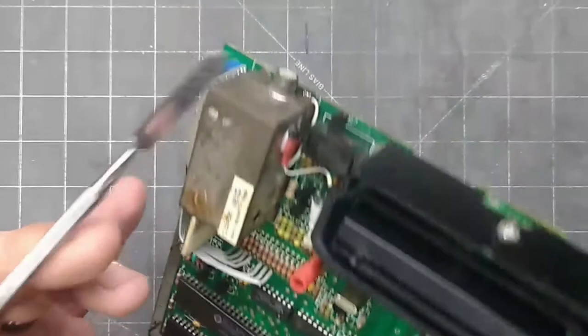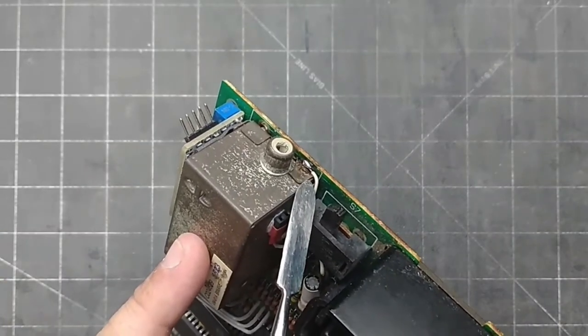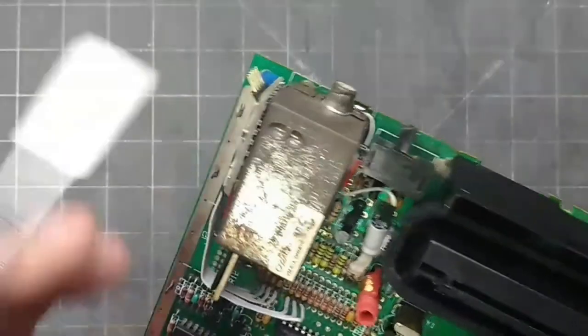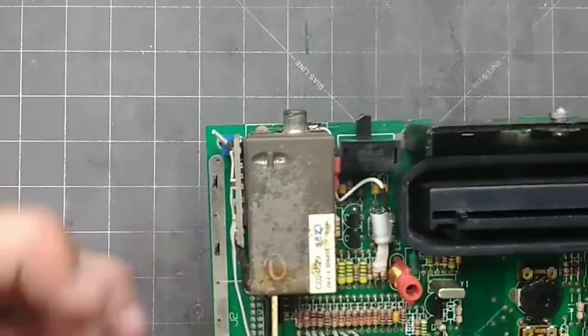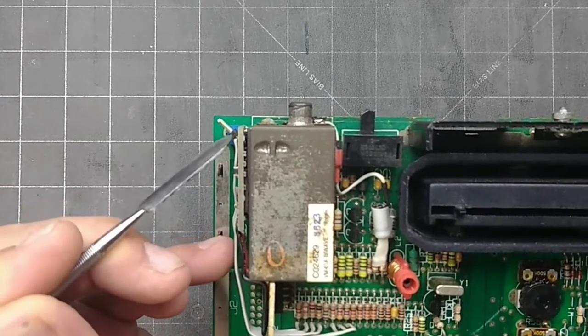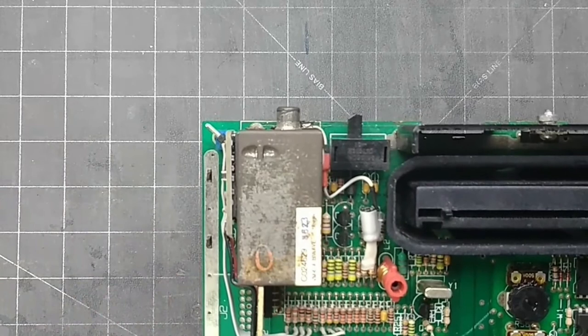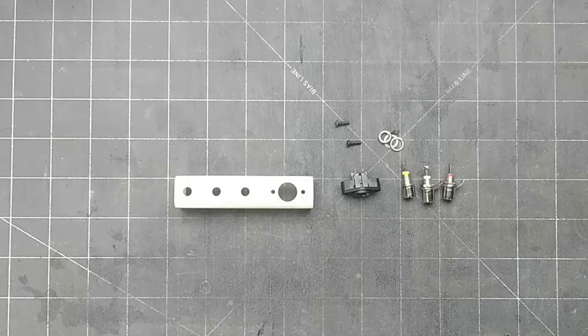I got the audio ground from the common ground on the base of the RF module. I also had to angle the pins to get better clearance from the shell. Speaking of shells, it's time to mount the AV jacks. I'm not going to be drilling any holes into my case. I designed an alternative method: this is my no-drilling AV bracket mount.